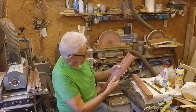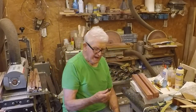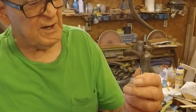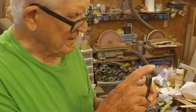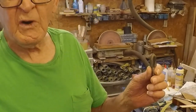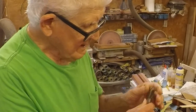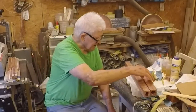Also, like I said, when I go to turn, the live center will sit in here and be a guide to drill it for the air hole. So I got all of them done that way — every one of them, just in far enough. What I'm going to do now is take out the V-bit, put in a half-round bullnose — this three-quarter inch one here. I'm going to change it out; I'm not going to move the fence, so it'll also be on dead center, centered up. I'm going to go ahead and swap it out — I'm going to make a light pass with this on everyone, then I'll make a deeper pass. I got them all routed out — one nice channel.